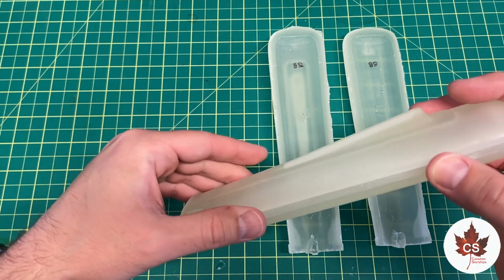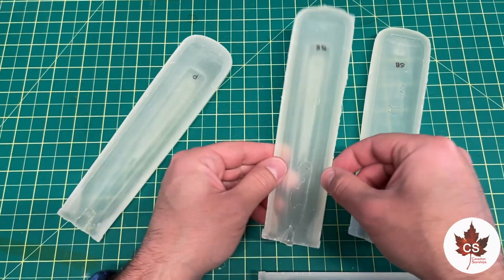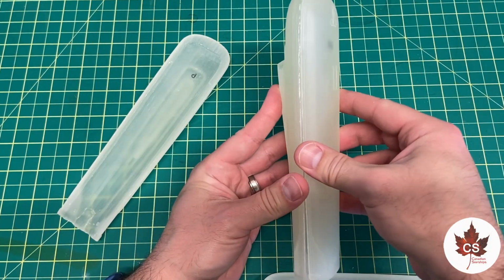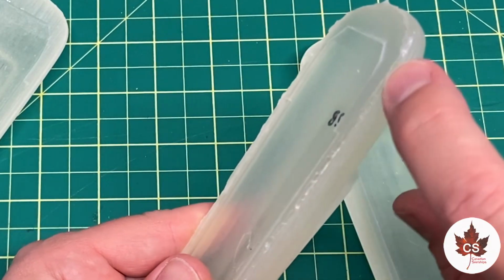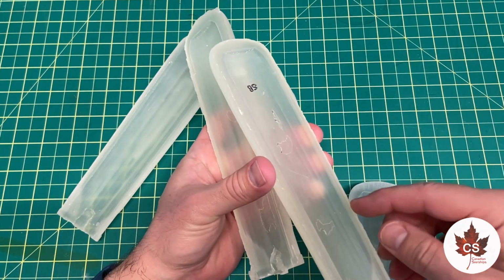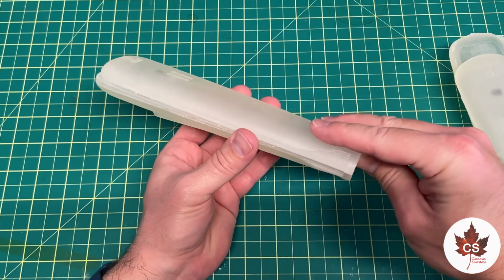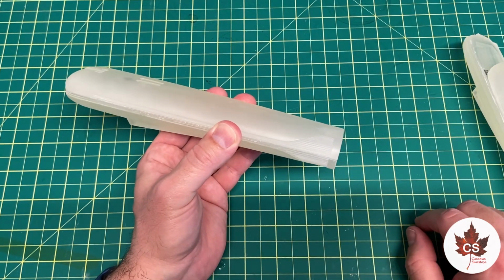And what I ended up doing, I started out by using my Dremel to try to clean this up, because I wanted to try to preserve, if you can see here, there's a recessed area here and then raised sections here, and those are supposed to be location points to help the parts go together. But when you get rid of all of this jagged seam line flashing, and there's a chunk of it on this particular half, you get rid of the recessed portion, which means that you then have to equally get rid of the raised section on the opposite side. So I ended up using my belt sander to get a nice flat even sand, and I'm just going to line these up manually without the location points, and I think that they will look quite nice.